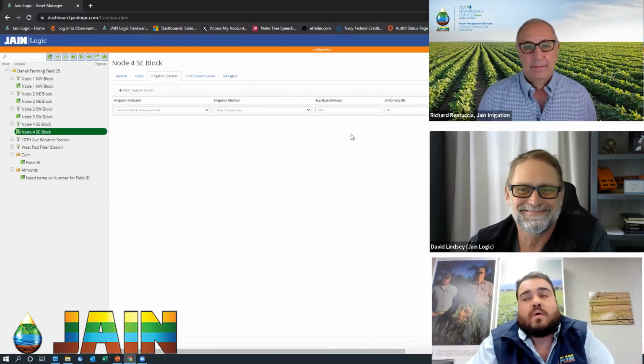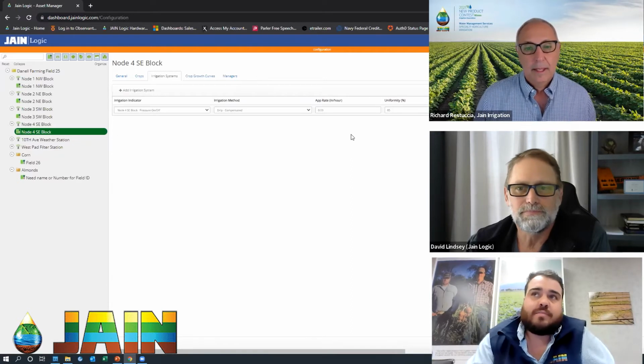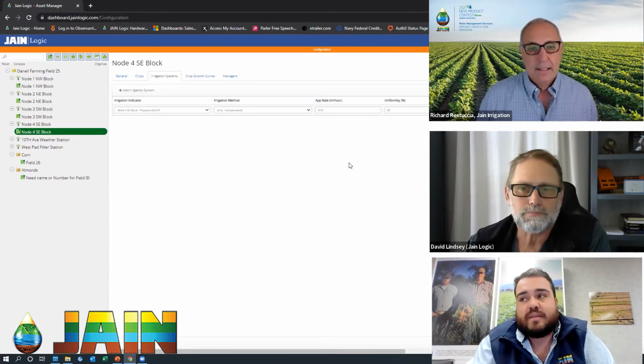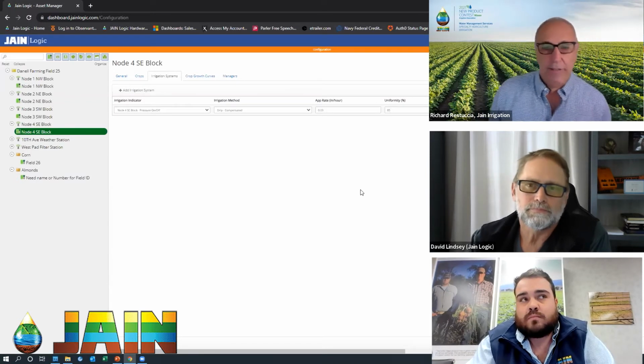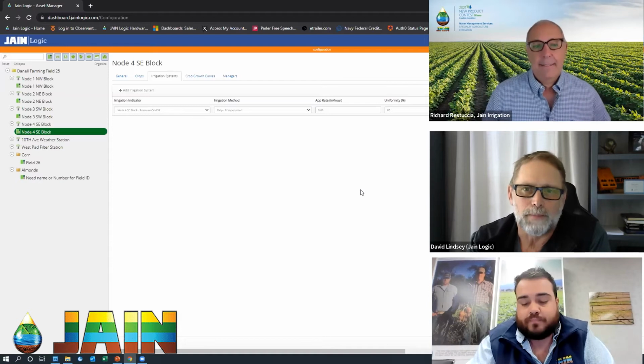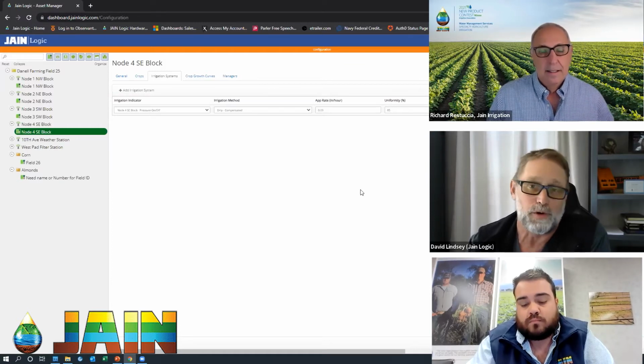You can call one of us or your irrigation designer, and we'll look into the emission device and see what the application rate is based off of flow rate, spacings, and stuff like that. So that information is readily available. It's not going to be hard to find or anything. No, not at all. Most designs you see for the irrigation system have the applicator inch per hour rate on the design itself, which is very convenient. You don't have to convert it.